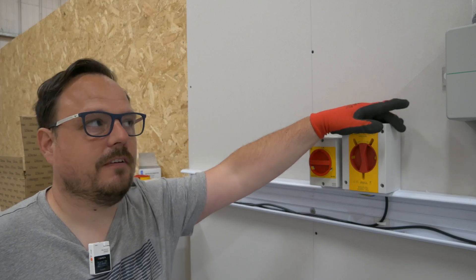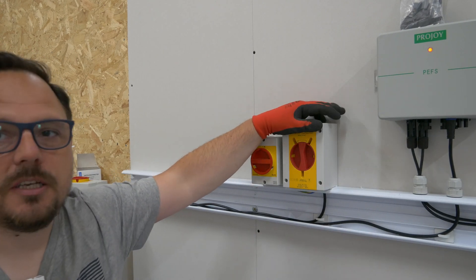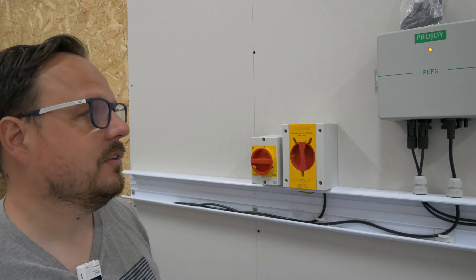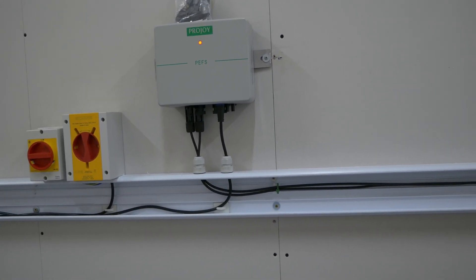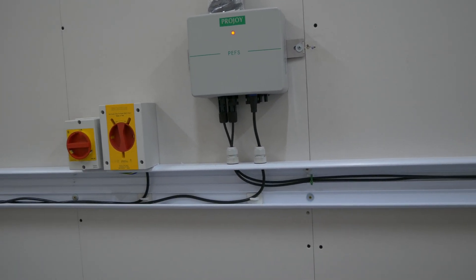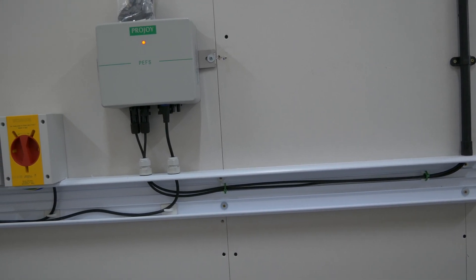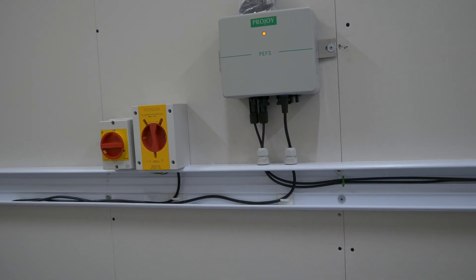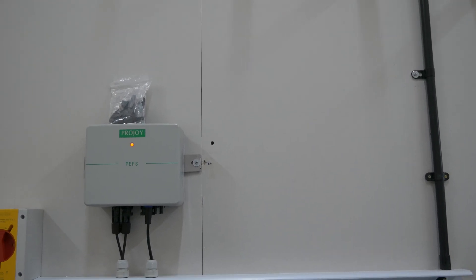This one here is just the emergency isolator for the ProJoy, which would typically be living up in the loft space. So that's a way of remotely activating this. We've used a rotary isolator because that's what I had in stock at Apprentice 121 HQ. You could use a stop button — however you want to do it — as long as it's labeled and can be operated. As you can see, we have our strings coming off the roof, dropping down this bit of conduit and running through our trunking. I've tried to keep the DC and AC cables separated as much as possible. My intention is to run the AC along the bottom of the trunking and the DC along the top. All these cables are rated to be inside the same containment, so I don't think it's a huge issue having them combined as long as you're labeling the trunking to let people know what's in there.